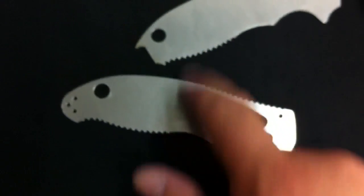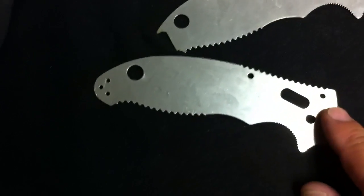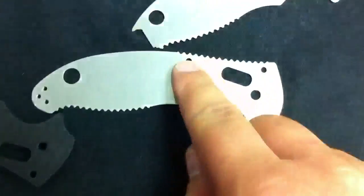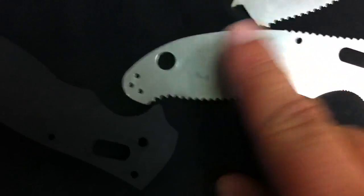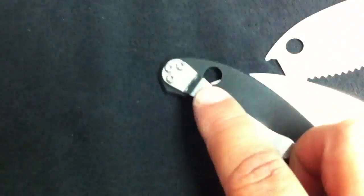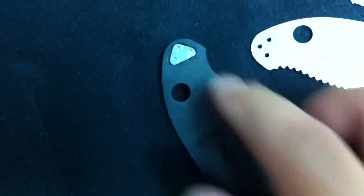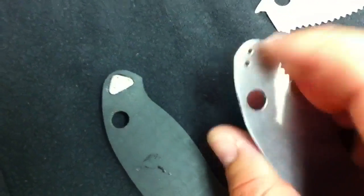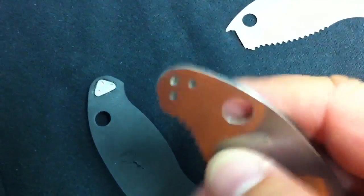Since you're not going to use your liners anymore, put your screws in them when you shorten your screws. I had to shorten these clip screws. The top ones aren't threaded, so you can't do it for those, but for the clip screws — these are threaded holes — put your screws one at a time, screw it down into your spare liner that's going to get thrown away. That way you have a holder when you're grinding on it and cutting it, and it doesn't get hot.